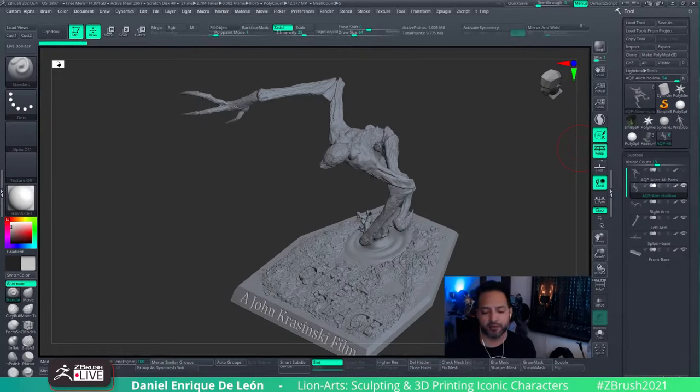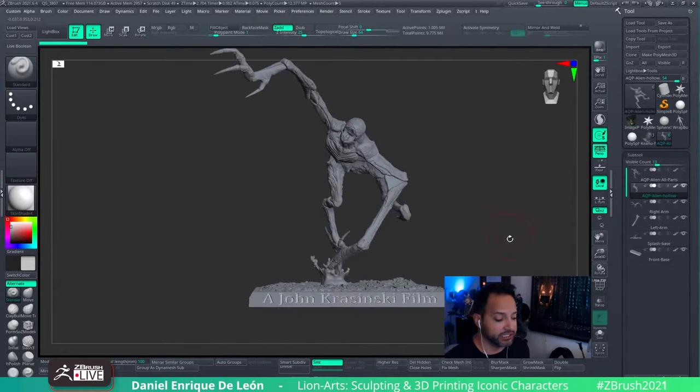Also, things that help with supports and hiding any sort of little nodules or bits that are left over are creatures like dinosaurs or these aliens, where they have a rough skin. You remove supports, and whether there's nodules left or divots left from the removal of the supports, the Form 3 is great for supports too. They remove very easily by comparison to other ones. They have the right middle ground for the attachment of the supports, so that they tear off really cleanly, really nicely.